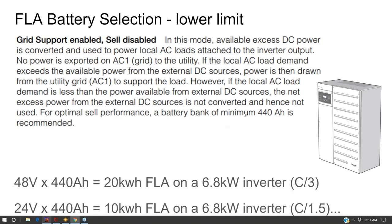So let's look at some other battery inverter features. In the Schneider system and the SMA system and these battery inverter systems, there is a mode that says we're going to interconnect to the grid, but we're going to disable backfeeding the grid. So they're monitoring the current that comes in from the grid, much like the electric meter on your house monitors the current. I do it a couple of different ways. Mainly, you clamp current transducers around the main feed going into the house, and it monitors, much like an electrician's amp meter, the amount of current that flows through.